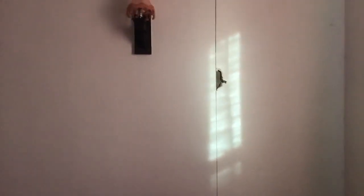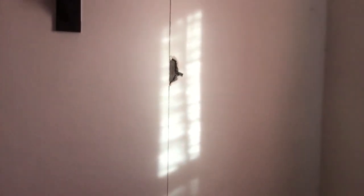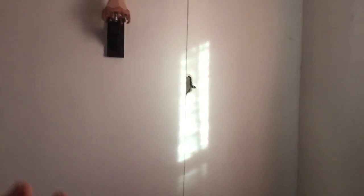This is the old black mortar, and the reason why this is cracked here is not a structural problem. It's because these old partitions were made of timber studs with brick on edge, and there is a timber stud perfectly where the crack has occurred - not structural, purely a cosmetic thing. But that wall will have to be hacked off. We've got evidence down here of rising damp.